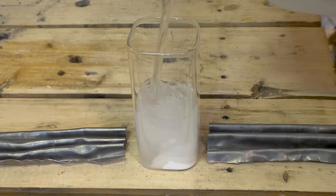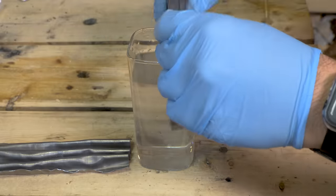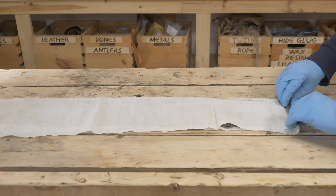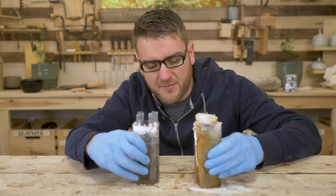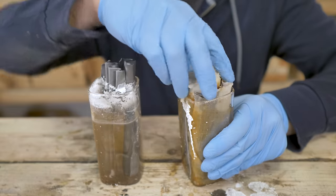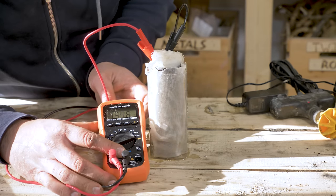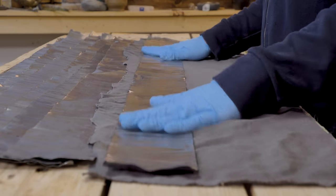When it comes to a battery like this, the amount of power and amperage is highly dependent on the surface area of the two electrodes. My first attempt, I tried to maximize that by zigzagging them. But I found out that what also maximizes amperage is the proximity of the two layers — you can get them super close. I coiled two long sheets of lead and separated them with a piece of linen so they don't touch and short, then wrapped it up. Both designs have about the same voltage — a little under two volts — but the coiled one I was able to get around half an amp. Charged overnight, I could briefly get it up to 12 amps, which is really impressive. We're still a magnitude away from a car battery, which requires a couple hundred amps, but pretty impressive nonetheless. So I'm going to go with the coil design and make an array of these batteries to actually power something.